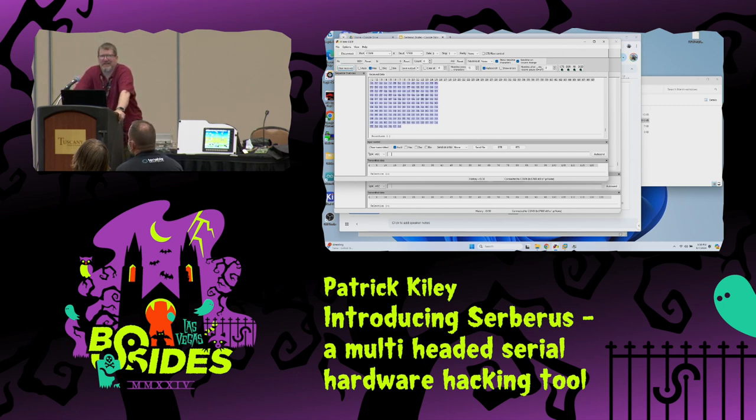Okay. So UART usually refers to the logic level signal. That'll be like the 0 to 3.3 volt or the 0 to 5 volt or whatever supply voltage is used by the digital logic, your microcontroller and all that. RS-232 is an older standard. And what they do is they take the UART signal in and then they drive it. It's single-ended, but they'll drive it either to like plus 12 or minus 12 volts. I think it can be anywhere in the range of minus 3 to plus 3 to plus 20 something to minus 20. So what ends up happening is if you have a logic high from a UART TX, the RS-232 line transceiver will translate that into a negative voltage, like negative 12 volts. And when you go zero, it'll do the opposite. So it's sort of like inversion. And boy, I just gave my age away, didn't I?